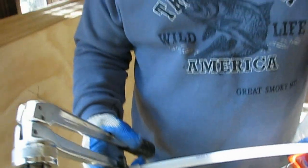And you actually end up with fewer joints, right? Because the tubing is flexible. You can make turns without having joints. Right. The best part about it is you almost appear to be an electrician because you run this almost like Romex. You can actually fish it through between floor stringers and wall 2x4s. You were showing me too.